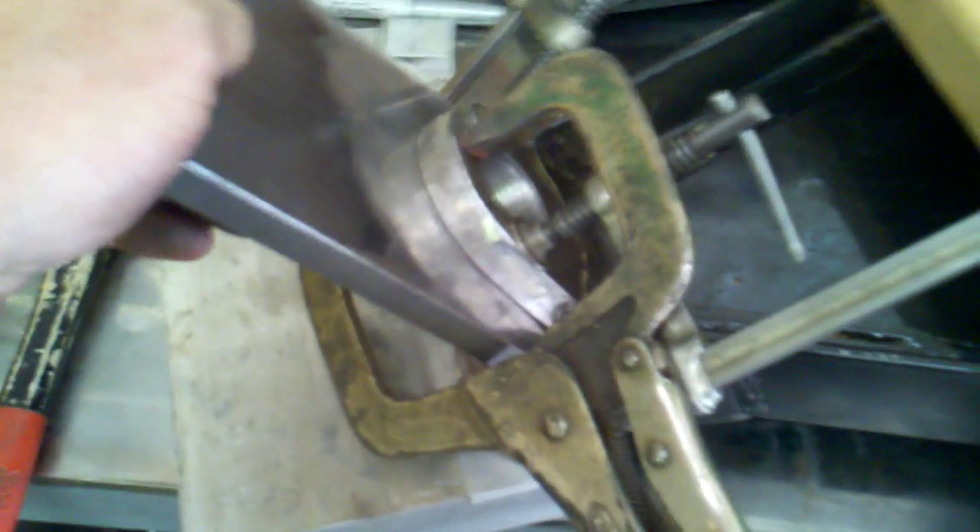I had to machine a plate here, and this plate is going to act as a base so I can weld part of the diamond — this piece here from the snowplow — onto this plate. This plate will allow me to clamp it in my Kurt vise on the Bridgeport.